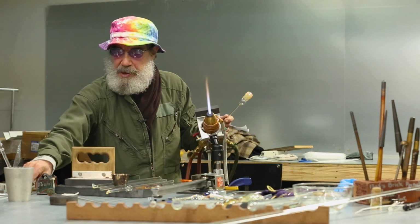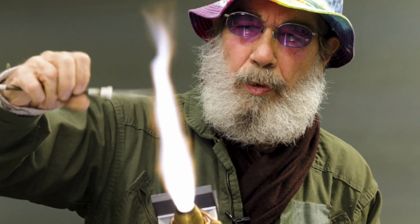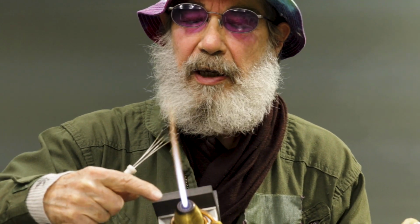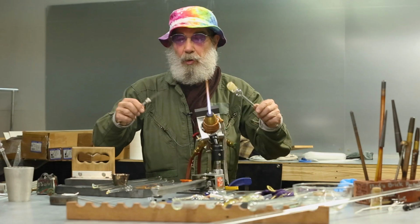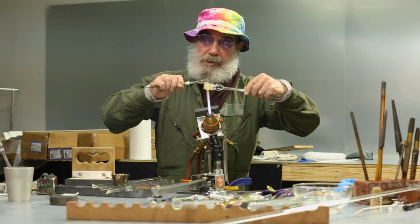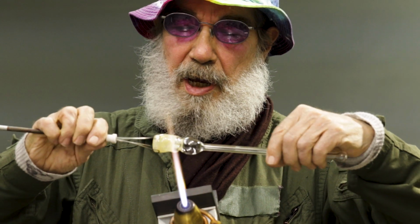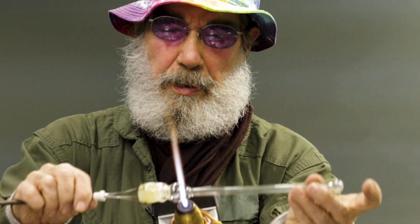This is where I can step in with a grabber tool. Always warm your tool. You don't want to warm it with that kind of flame. You want as soft and bushy as you can get, or a yellow flame, just gas on some tools. I've seen more people screw up their tools with the torch.